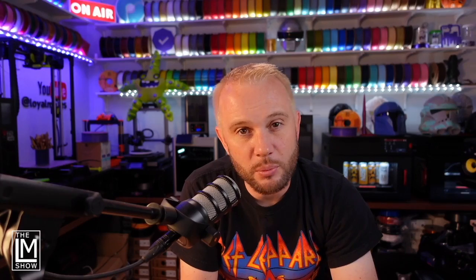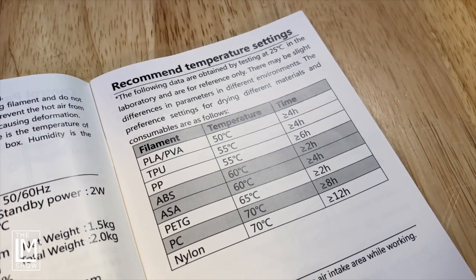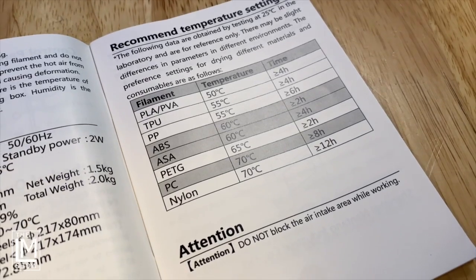As far as how much time you'd need to keep filament in a dryer, that's going to vary depending on how much moisture is in the filament, how hygroscopic it is, and how dry you need it. Anywhere from two to four hours is a good start for filament that's not waterlogged. If you think there's a lot of moisture in it, you're going to need six, eight, or twelve hours at a minimum. For filaments like nylon and polycarbonate, or heavily waterlogged filament, you're probably looking at twelve to even twenty-four hours of drying.